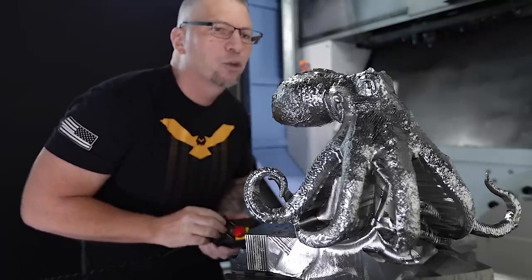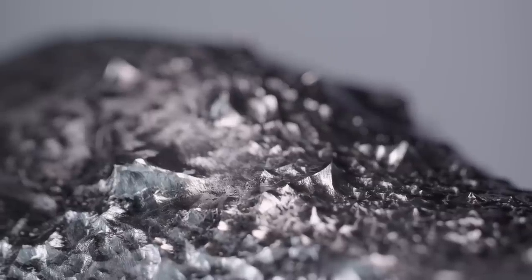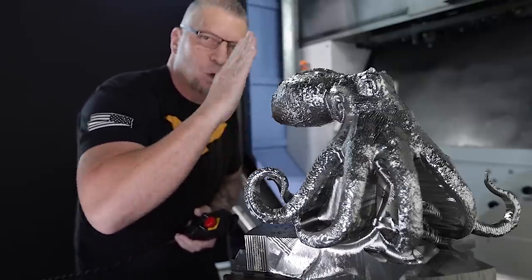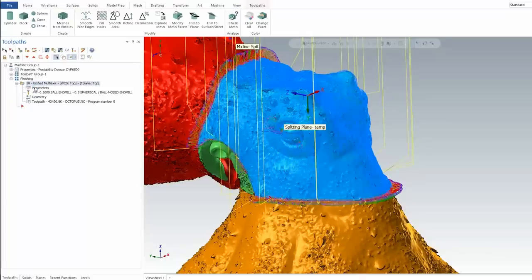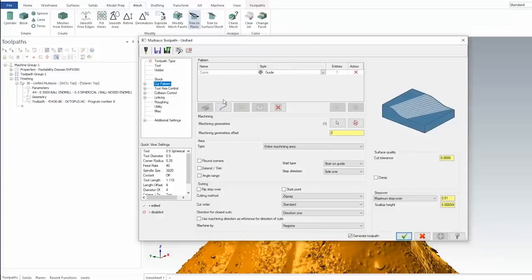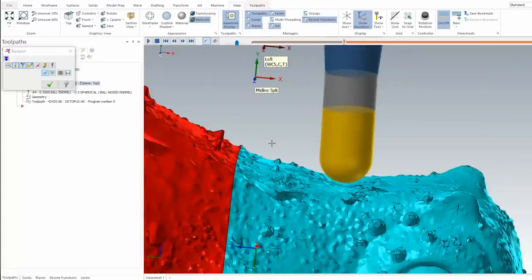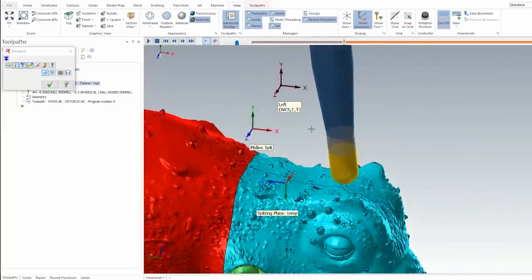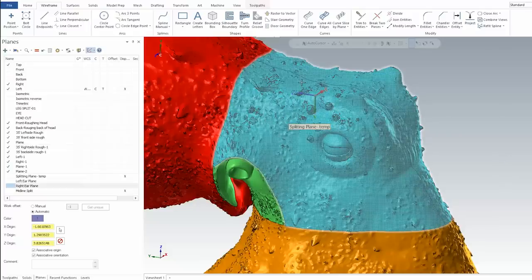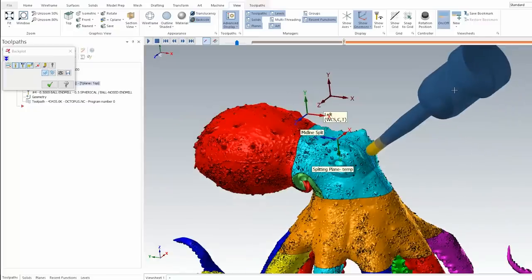It's new for 2022. When you look at this octopus you can see just crazy surfaces going everywhere. For the main toolpath I needed to make sure that I wasn't going to be limited — a lot of toolpaths are for an angle, or for a flat, or for a certain radius. This particular toolpath actually incorporates parallel, along curve, and project all together, so as you go over a surface to another surface it'll incorporate multiple toolpaths seamlessly. This was great because I was able to just grab the head of the octopus, wrap all the way around it, and allow the Mastercam algorithm to take the toolpaths and put them together to make it absolutely perfect.